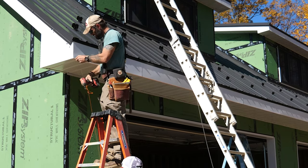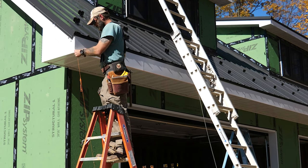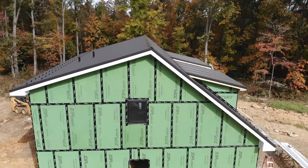The sub-fascia boards on the front side had quite a bit of crown to them and weren't perfectly straight, so the guys used a string line to make sure the fascia was hung straight. Well, that is the scoop on our soffit and fascia. I appreciate you watching — hope you got something out of it and we will see you next time.